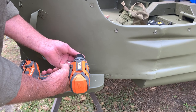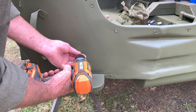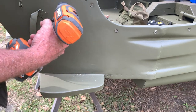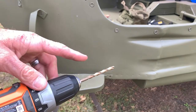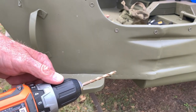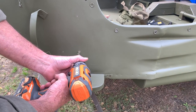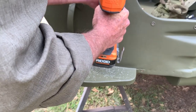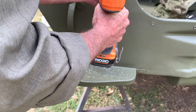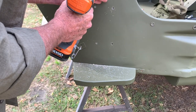I'm using an eighth-inch drill bit to drill a pilot hole exactly on my sharpie marks — this helps when using the larger bit so it doesn't jump on the sheet metal and damage the finish. Then I'll use a 7/32-inch bit, which should give enough room for any discrepancy or adjustment when installing the fasteners. Take your time, maintain a 90-degree angle to your work, and drill all six holes. It will cause quite a mess of little metal shavings — we'll clean those up in a minute.